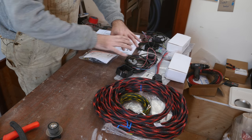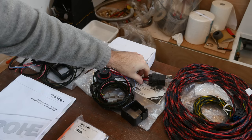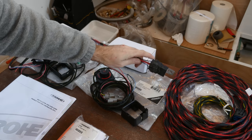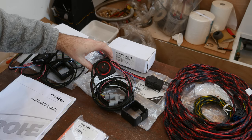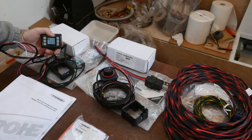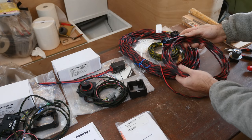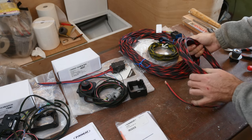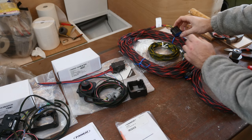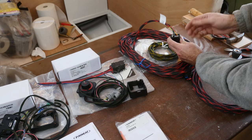Let's move on to the wiring. This is everything I need to connect to get the system up and running. There's a relay — I'm pretty sure it's for controlling the fans on the fan heaters — then there's the thermostat for setting the temperature inside the boat, and there's the PFC, the ProHeat Function Controller. There are two cables I need to connect to the heater itself: the power cable and the control cable. We need to make a small modification on the back of one plug first.